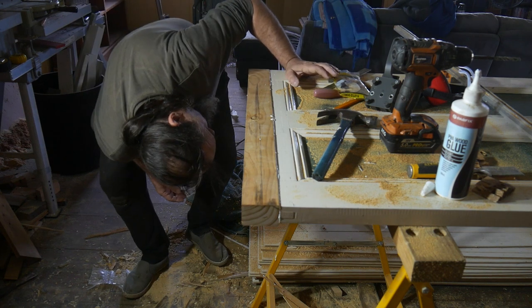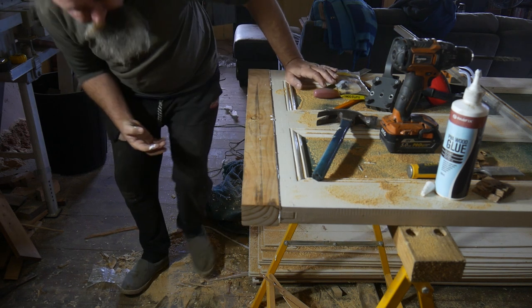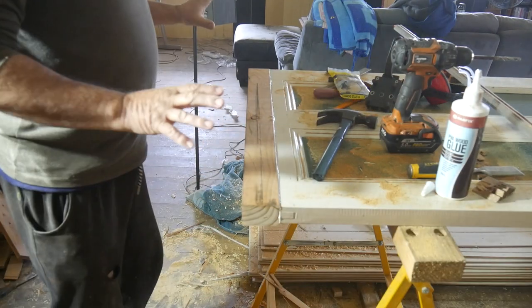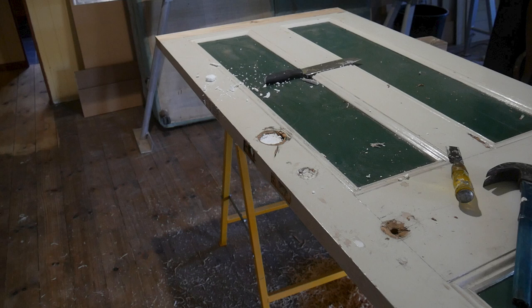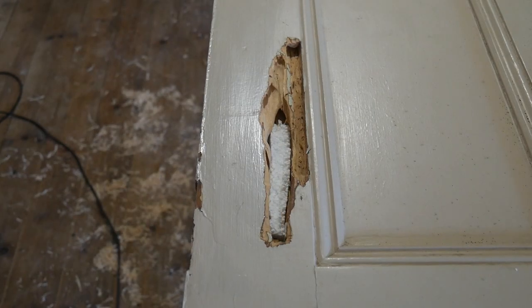There's more termite holes in there, but we can just fill those up — they'll be alright. It's a little bit crooked but once that's all dry we'll just plane it off. In the meantime we want to fill in these holes. We'll be using builder's bog, because once mixed it goes off within an hour or so and it's as hard as wood. To fill in this large hole that was for a door handle, we don't really want to fill it entirely with bog because the stuff is expensive. So we can cut out some polystyrene foam and fill in the majority of the hole, and then the bog would just go on the last five millimetres or so of the surface. We can do the same with areas of the door that have been eaten away by borer.